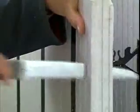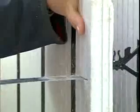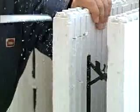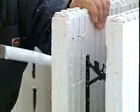Another thing to watch for is the installation of fixture boxes in walls created with 4-inch forms. Remember, the EPS panels on 4-inch forms are thinner than those of other forms. When using 4-inch forms, take time to pre-plan fixture box locations.